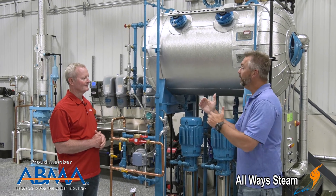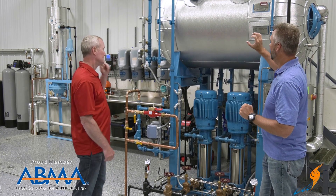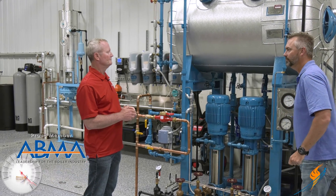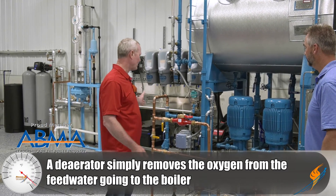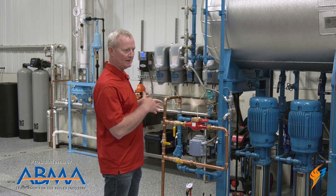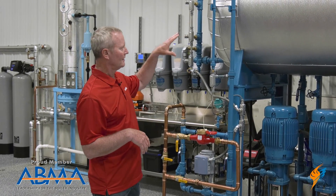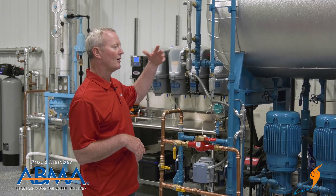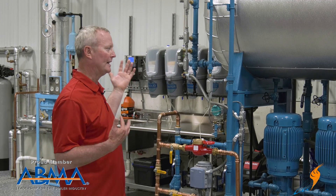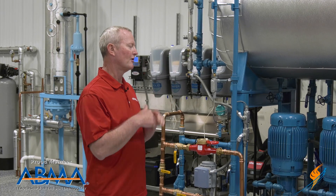We've shot some episodes before, but I think it's good to go over again, specifically this one, and talk in depth about it. So, what does a deaerator do? It takes the oxygen out of the water. We've got soft water coming in — anytime you have soft water, it's really high in oxygen concentration. If you put that in the boiler, you destroy the boiler, eat the tubes up, and so on. The deaerator does exactly what it says — it deaerates the water, gets the oxygen out, and that's vented outside so you have 99% pure water going in, keeping corrosion out of the boiler and out of the piping.